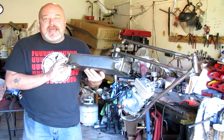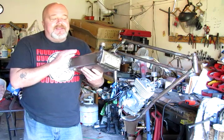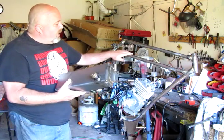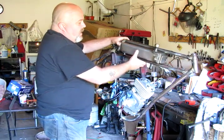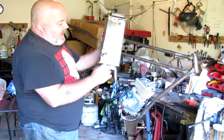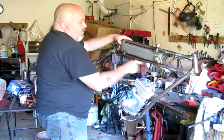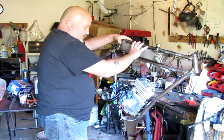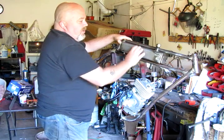I've had some issues before making gas tanks. I brazed — the brazing holds together very well, but the heat winds up warping it and I'm not pleased with the final shape. I'm building a motorized bike here with the wizard motor on it. This gas tank is going to mount here. I have two tabs on the front, two on the back, where I'm going to be welding plates onto the frame. That's going to hold the gas tank in position, and we're also going to have a shroud over the gas tank, so this is going to be concealed. I'm going to have electrics here.